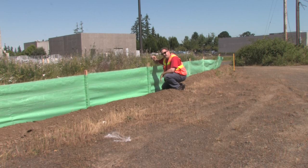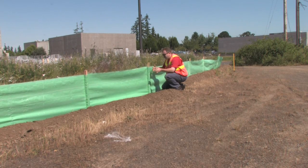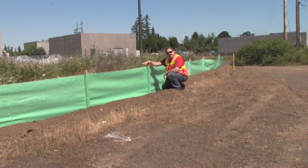Just making the seam tighter. If we installed this 180 degrees backwards, the pressure would want to tear the seam apart and just throw the fabric right off of the post. This is the correct means of installation for the sewn-in-pocket silt fence product.